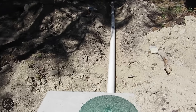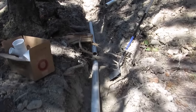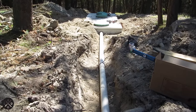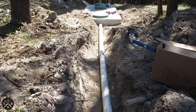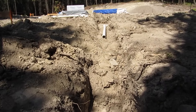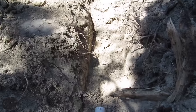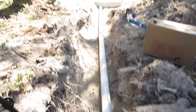Quick tour here — I've been digging away and this is the ditch. If I turn around, that's the septic tank, and that's where I have to start from because it's set where it needs to be. To come up to the house you have to do a quarter-inch per foot slope. My drain line is coming in right up there. There are a lot of rocks, so I have to step down using either 22-and-a-half or 45-degree fittings. I've got my first couple of pipes in.